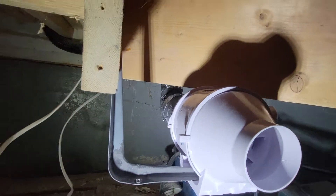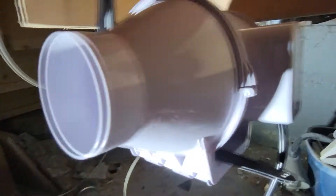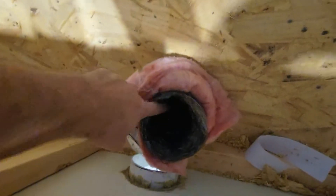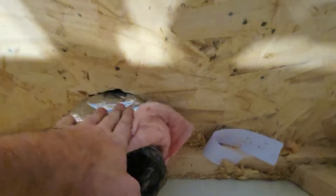So I want to show you guys how I set this up. All I used was just a hanger — there's a little piece right through so this kind of sits upright. We connected the 3-inch with the 3-inch, then we put aluminum tape, and then duct tape. Before we finish, we are going to put an additional layer of this protective HVAC foil. We decided to opt for one long pipe through here instead of toying with these galvanized ones. It's a little more expensive, but we fed the whole thing through.